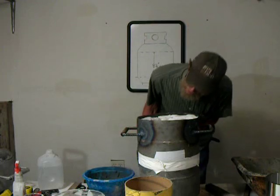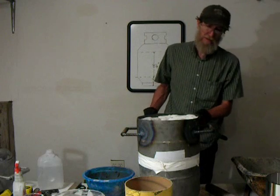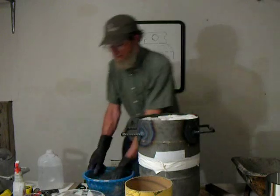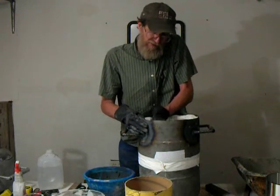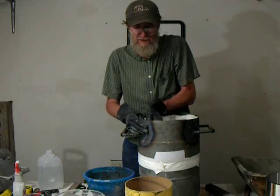Now what we want to do is cut four holes on one side. We're catching a little bit of a seam here and also where the handle stood in. We're going to pack that by hand with refractory cement to give us a good bearing point and hold everything in close.